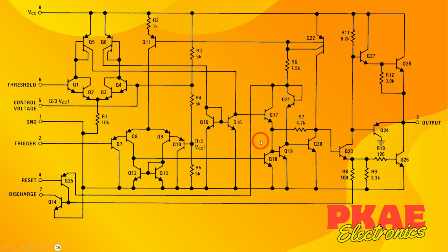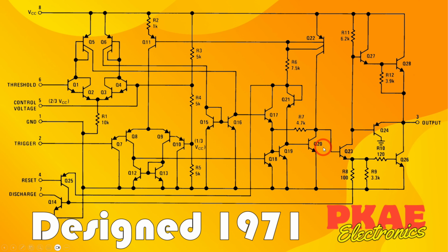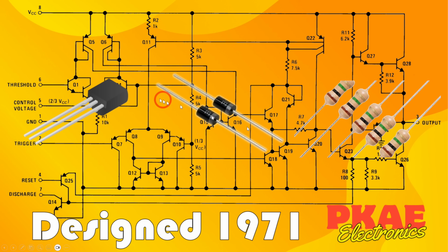This is the circuit diagram for a 555. It was designed in 1971, so it's very old, a long established chip and still very, very popular. But inside here, you've got transistors, diodes, and resistors. There's absolutely nothing in here that gives you any form of time base. But that's not really what this video is about. I wanted to go through how a 555 timer works and how you actually make it into a timer with the components you put around it. So let's take a look.